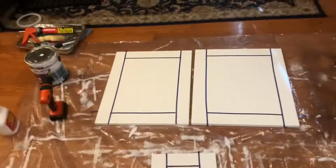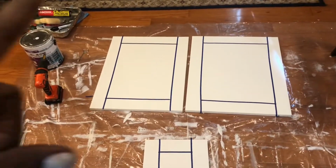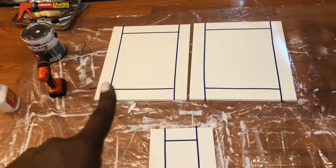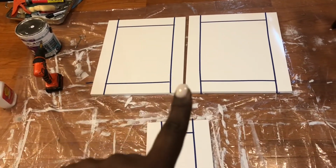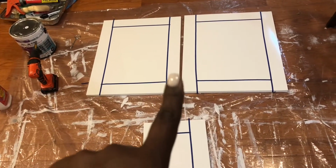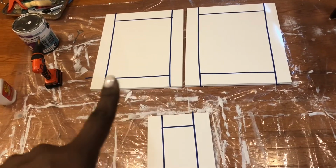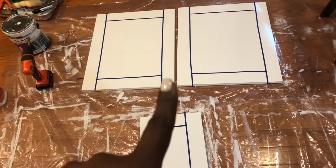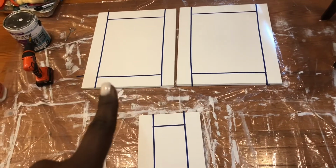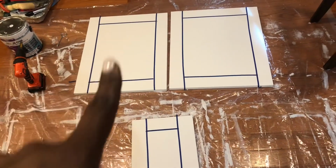And so how I measured the cuts, as I told you, the door on the left is 18 inches wide. But the boards on the left and right hand side are both 2.5 inches. 2.5 plus 2.5 is 5 inches. And so that means that though I have an 18-inch length, I have to subtract 5 inches because they're going to be taken up by those sideboards, which would leave me a 13-inch board in the middle on the top and bottom.